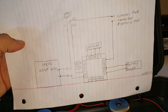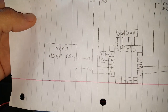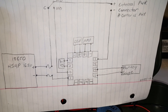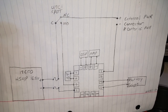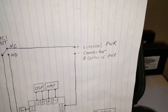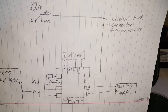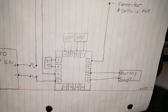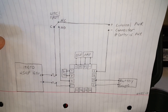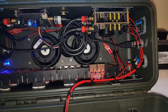Here's a simple block diagram of the power distribution. The 18650 4S4P pack comes in through two fuses. The negative goes to the board; the positive goes to the single pole double throw switch. In the normally closed or off position, it goes to the external power jack for charging. When you turn the speaker on, power is routed to the board, and from the board it goes to the Bluetooth, DSP, amp, and the battery gauge. That's just my design preference.